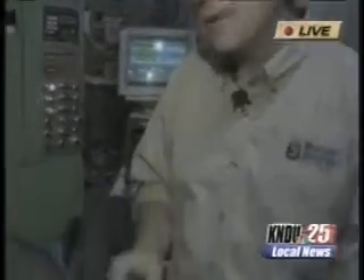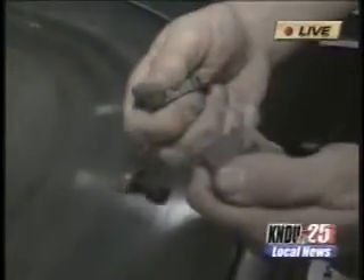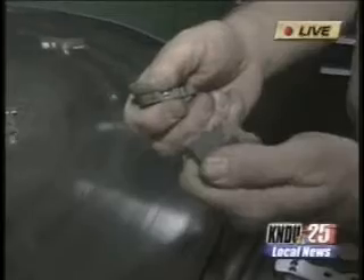Here's a demonstration — it's still in a powdered form, there's still one more process. There we go, a metal part that you can kind of easily break down. What's the next step after you form the part? We move on to another step — it still needs to go through sintering. During sintering, the metal particles will bond to each other and form a solid steel part.